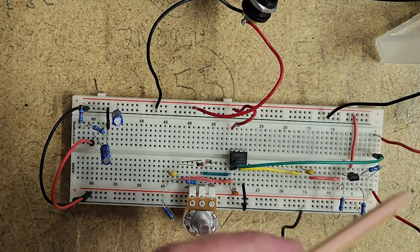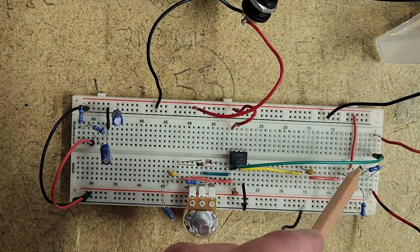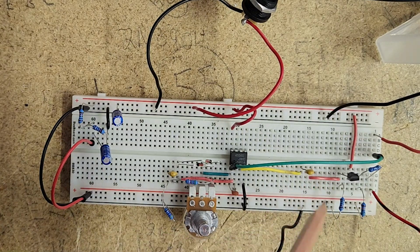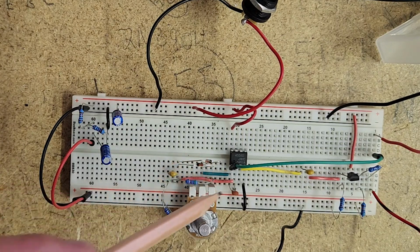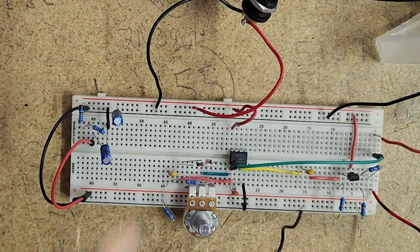Here is that boosted area with this transistor. We've got just those input capacitor and resistors going into the transistor, bringing my 9 volts in down to there, and then the biasing current coming in from my 4.5 volts. Then that is going through just a capacitor. That's probably a DC blocking capacitor there. And then we're going into the op amp. And here's our feedback loop, where we have the 2 diodes going in different directions and our resistors, and then the one going to ground to create that voltage divider for the op amp. And then coming out of the op amp, boom, out, it makes noise.